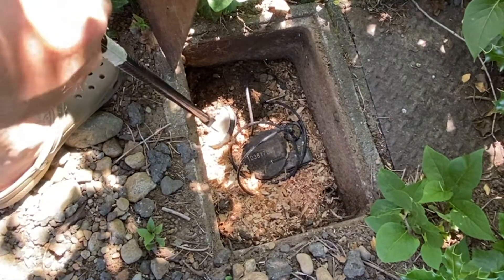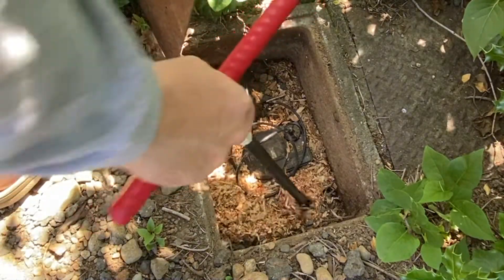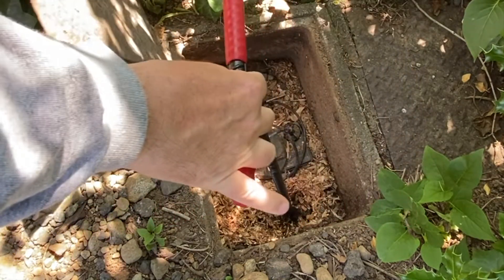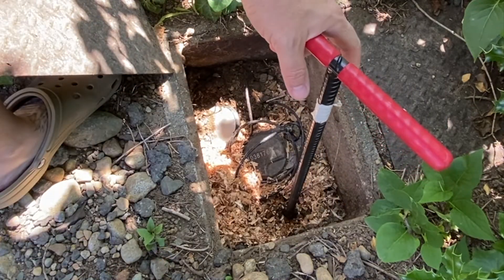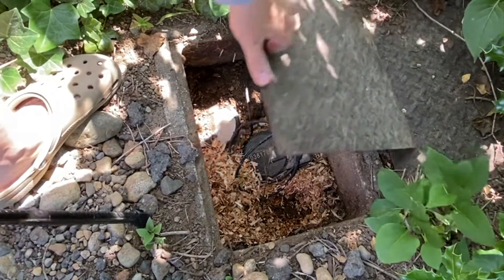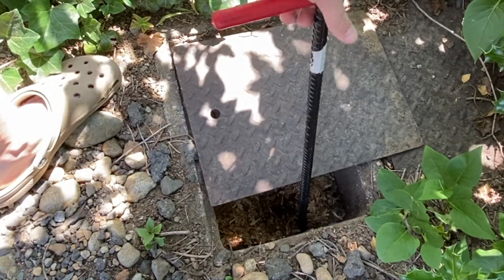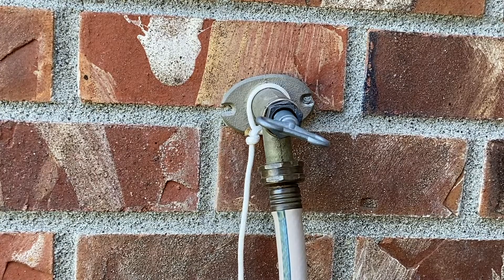They put something new on my meter where they can just come and scan it, filled it up with a bunch of wood chips. I don't actually have a shutoff to my house, so I come out to my meter for right now. When I open up the wall to fix this hose bib, I'm going to probably install a shutoff valve to my house too — another reason why I don't want to do it in the summertime because I've got to get in the crawl space. Now the water's off.